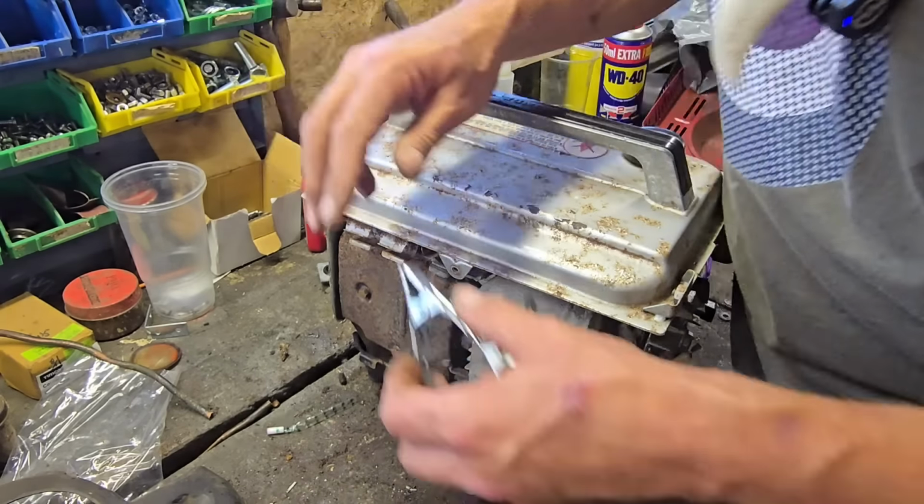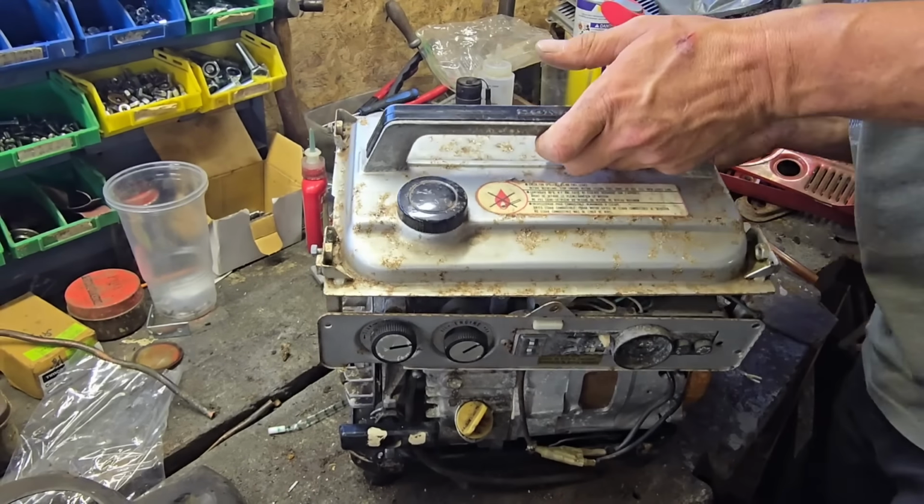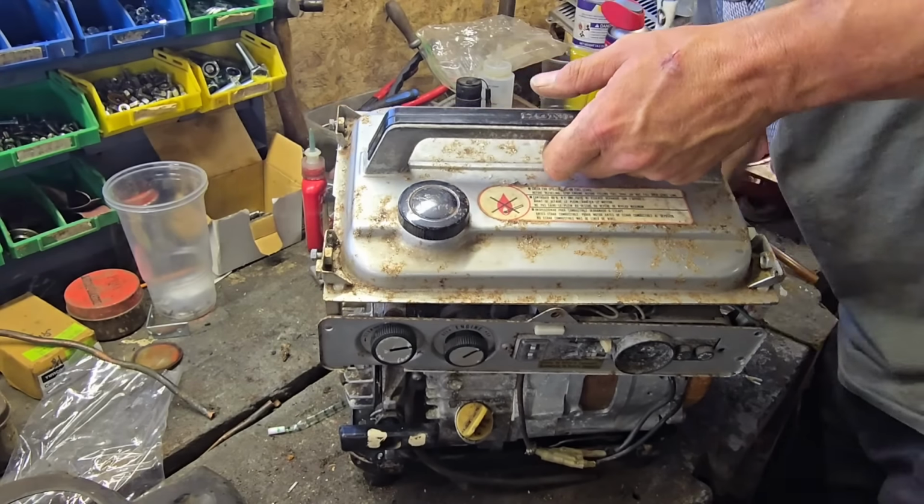Is there any wire what could stop this from sparking? Now, this is just a fuel pipe. That's a fuel pipe. No, that's a carburetor overflow drain. Oh my word. Right. I'm just looking to see if there's anything obvious what's killing this engine. Where did the kill wire go? It comes on the back of this switch, look. So we have a switch here. And that's where your kill wire goes. Right. That is definitely in the engine on position.